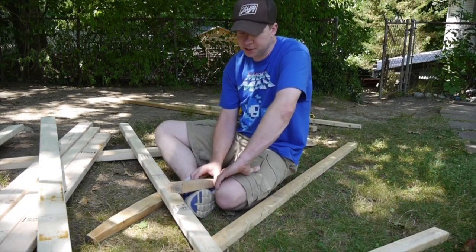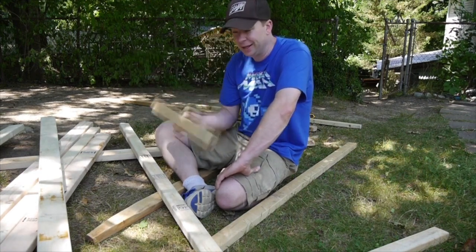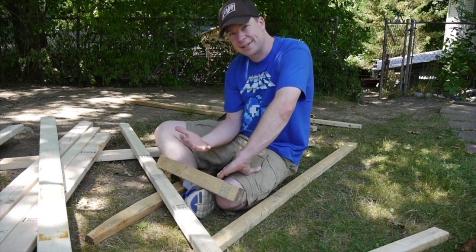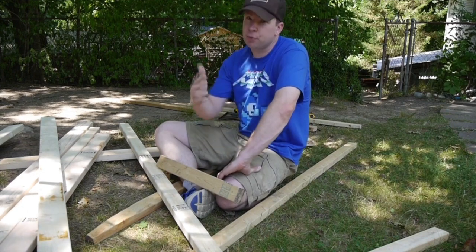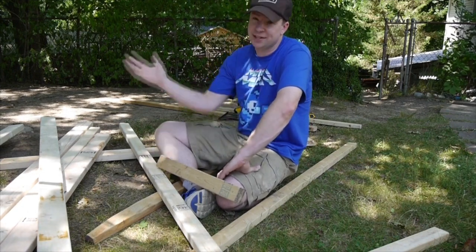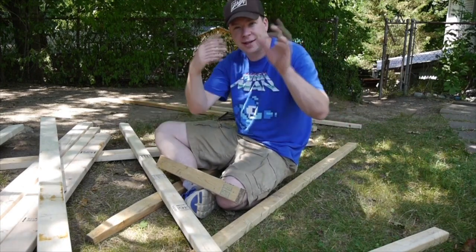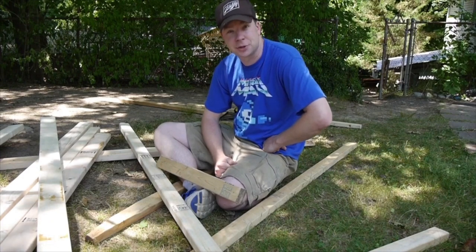The fronts can be rather unusual. It's going to be cobbled together with a variety of scraps I already have, using up all the stuff I got, and a bunch of new stock — 2x4s by 10s that I just purchased. Each wall section can be fairly heavy, but light enough where I can prefabricate each piece, bring it to the site way out in Connecticut — I'm in Massachusetts right now — and erect it as one and save myself some time and some backache. So here we go.